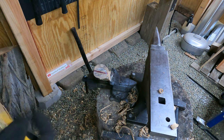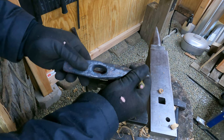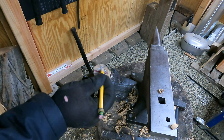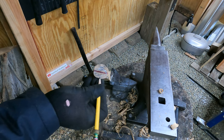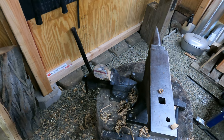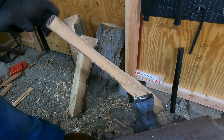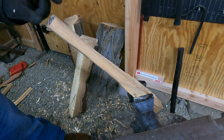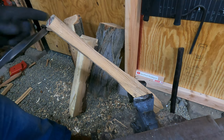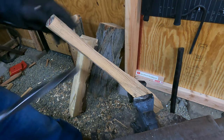Right. Roughly, what we're looking at here, it's not showing up because of the mill scale and stuff falling off here. Is looking at here and here. All right. And now I did that terrible job of tracing out that eye, but I can see where it's supposed to be. I got about a quarter inch of material on each side to remove. I'm within an eighth on the other side, so gotta be real careful. So just gonna continue and keep removing material.